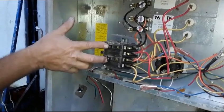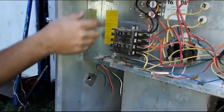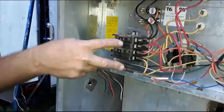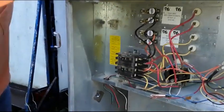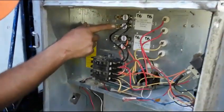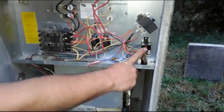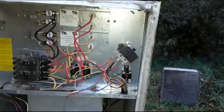You notice it takes 60 amps right there to run all these. You wouldn't want all these to kick in at one time — it'd trip the breaker because it's just such a heavy load. So it does a little bit at a time. And this is a fan relay, and this is your transformer to get the voltage from your thermostat.